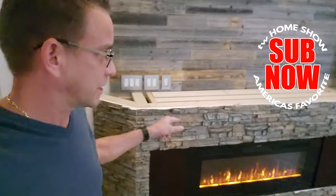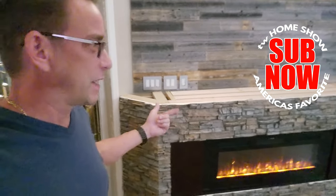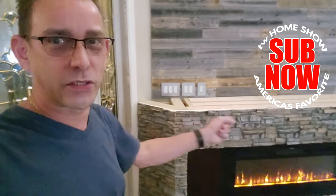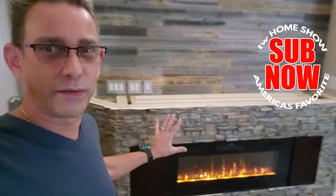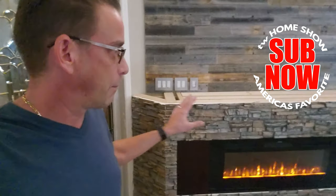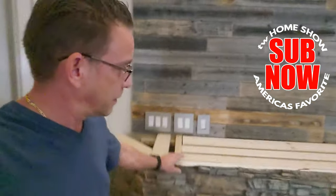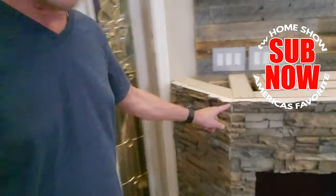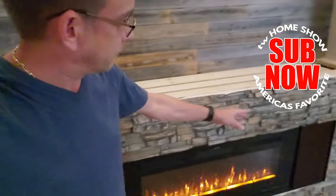Since I sheeted it with quarter inch plywood, I might get some longer brad nails. I think I already have some in the garage, and hit certain spots of this with the longer brad nails, maybe 2-inch brad nails all the way around. And I might just have it attached with brad nails on this part of the installation process. It's pretty sturdy. It's not going anywhere. And all I have to do is some light caulking on my corner seams, really nowhere else.